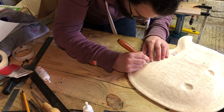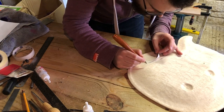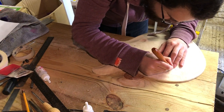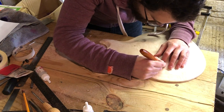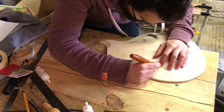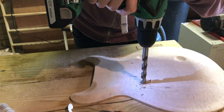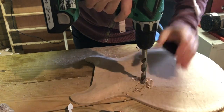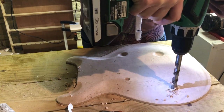Once I had those reference holes on the back, I stuck a template for my f-hole to the top — just a paper template on masking tape — and then scored around it using a marking knife, because I couldn't find my scalpel. Everything was still in boxes after the move; I spent hours looking for my thumb planes. Once I'd marked that out I drilled two holes, one at each end as close to the shape as I could get — about a 12mm hole. I filled the marking with pencil so I could see it more clearly.